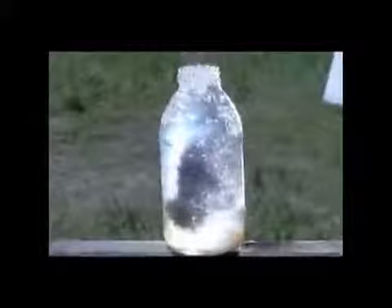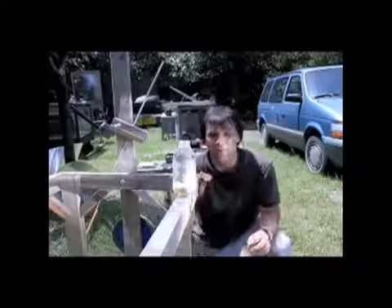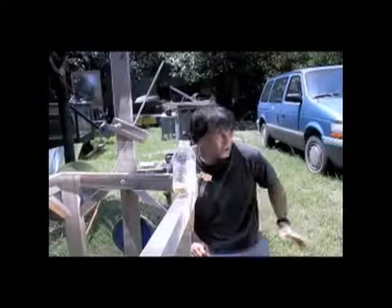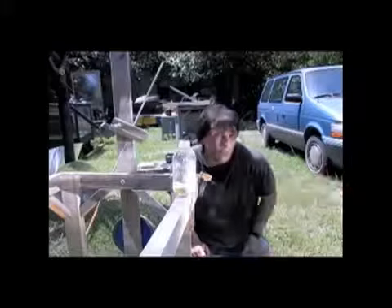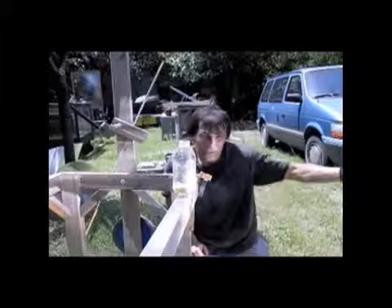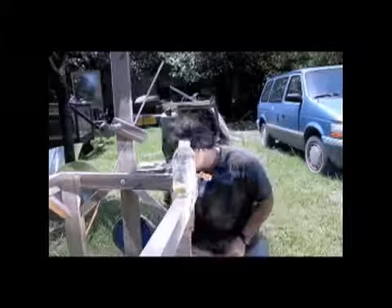This is pretty impressive because you can increase or decrease the focal length — make it further or closer just by increasing the vacuum. You can really make this a larger one; you can probably get a focal length of 30, 40, 50 meters, which is cool because the further away the focal length is, the more mirrors you can array into one spot. We're going to be doing some stuff with this in future videos. We were able to get water to boil in five minutes, and you can see it does a number on wood. I'm your host Dan Rojas — thank you for watching and enjoy our videos.